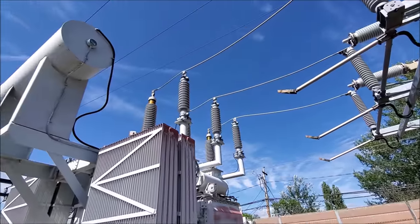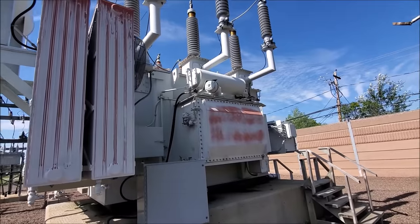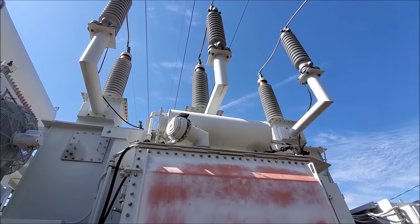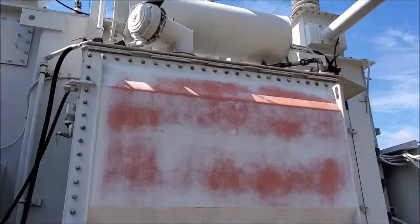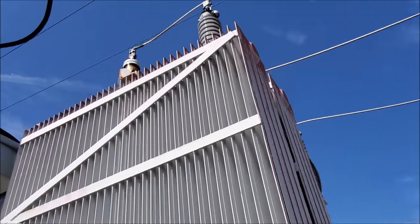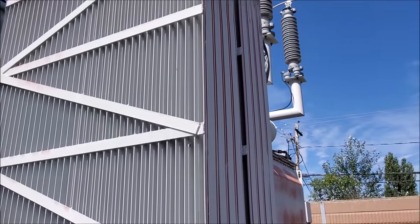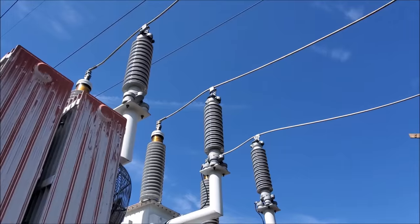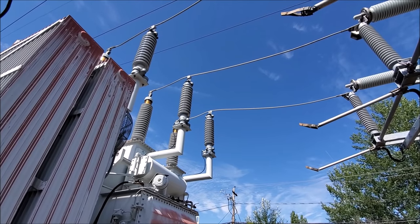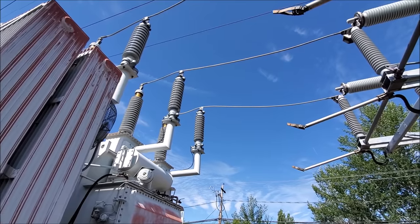After our circuit switcher we're coming into our power transformer. Now like most transformers, these fellows are filled with oil — they're just a much larger version of what you see on a pole. Much like a car, the oil is used for cooling. As the transformer gets more and more loaded it will heat up, and the oil, which travels through these radiators, is cooled off. We also have an expansion tank — or conservator tank — up here. What you see right here are lightning arresters. They are an actual physical path from the high voltage line to ground. Basically when the voltage gets too high, this allows it to bleed out into the ground — that's why they're lightning arresters. It mostly gets used during a lightning strike.